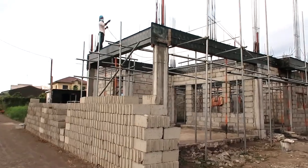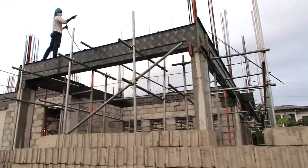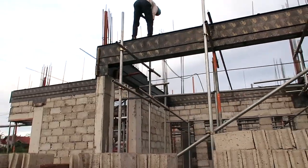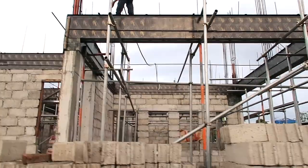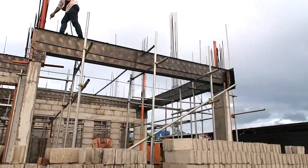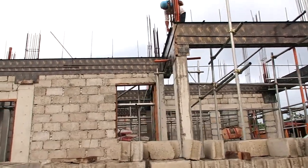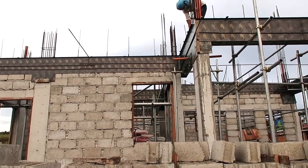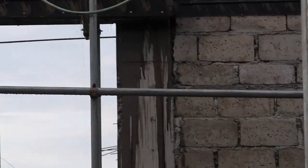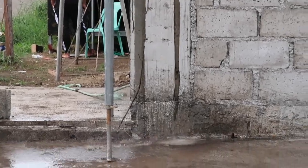All right, it's 5 PM. Currently one of the guys is watering the inside rebar of the beam because we told them to wash off all the ash from the volcano — it's not good combining with the cement. I'm also worried that our sand and gravel might have some mixture of the ash. You can see how much ash gets stuck between the beams — it's all running through our column, all dark ashes.